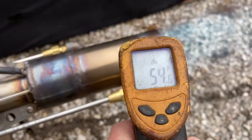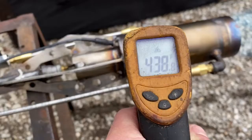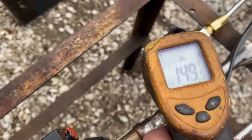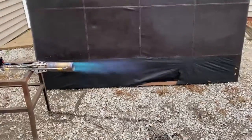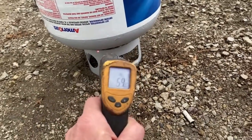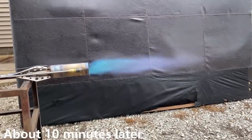We are now boiling propane inside of this cowling — otherwise this thing would be just as hot as the rest of it. What that enables us to do is run off a generous 50 to 60 PSI of liquid propane in freezing cold weather, boiling it inside the nozzle. We won't suffer any additional bottle pressure loss. We can stay at this extremely high output — probably double what that Chinese torch was showing us, because the flame is bigger around and it's burning inside this thing as well.